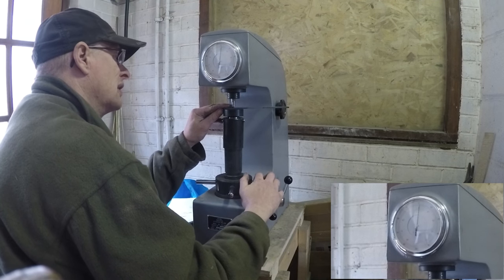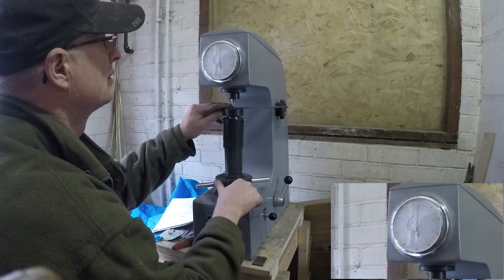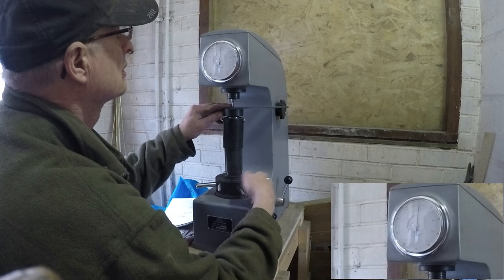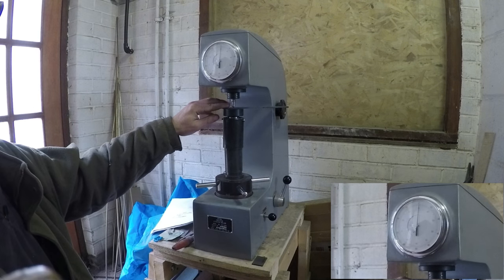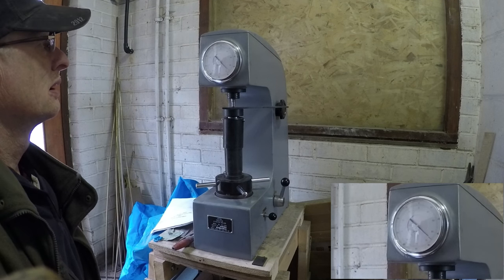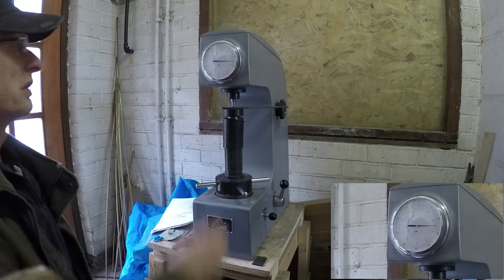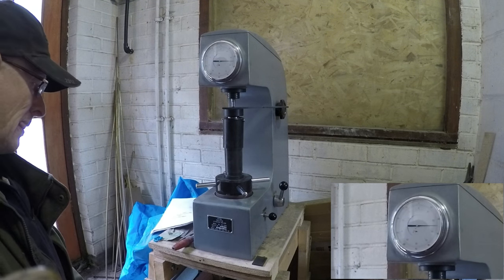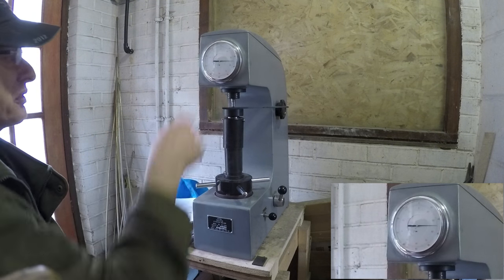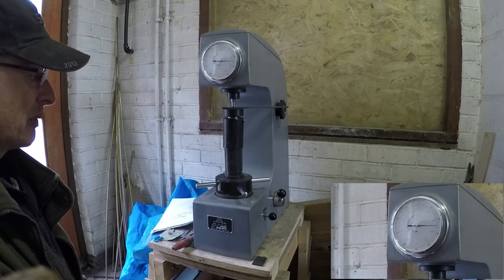They're all coming out nice. This will be the last test now, so I'm getting close to the edge. I know that where it's coming to a halt over here, it's in the sweet spot, so to speak. If it had gone up too far or too low, it could have indicated decarbing or a slightly warped blade. But this has all come out very well.